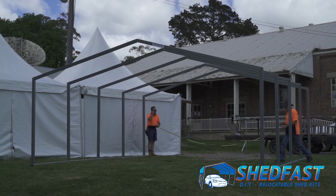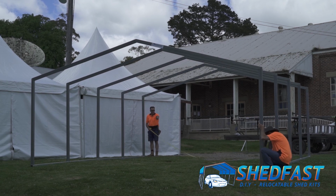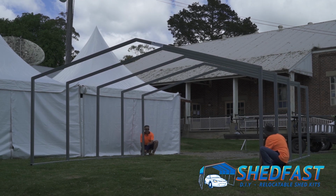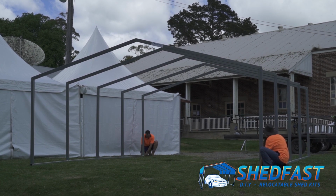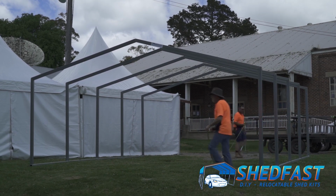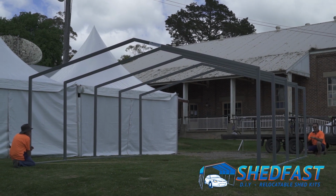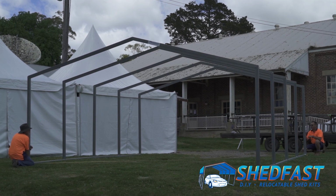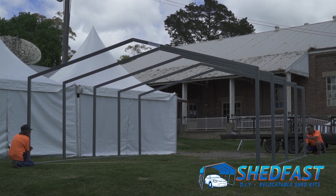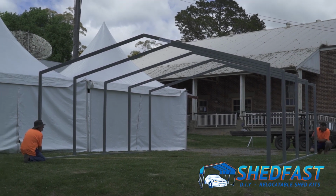And at the back. We'll do the diagonal first, yeah, let's do that. So front to back, so you want the inside corner at the front, inside corner of the base rail, that's it. And always measure to the same place. Okay, so we've got 8 metres here, so we'll go to that corner. 85-50, so it's not unusual to be out 300 mil and not really notice it until you do the measurement. So it's always important to check. So that's 85, so what happens is this has to go forward and that one goes back. So I'll move this one forward a little bit.